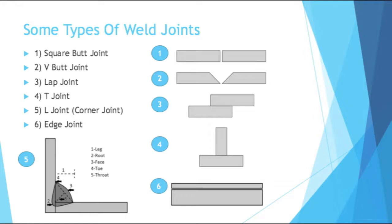You have a V-butt joint. Similar to a butt joint, but there's an angle on each shape — it kind of makes a V shape. You have a lap joint — that's when two materials overlap. You have a T-joint. That looks like a T; there's overlap as well, but it's different than a lap joint — the two materials are perpendicular to one another.